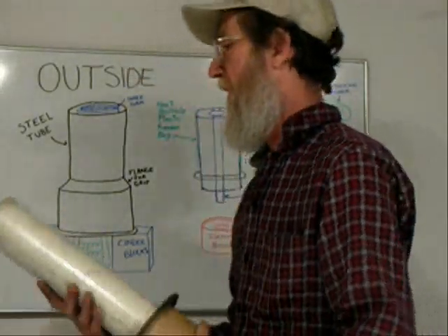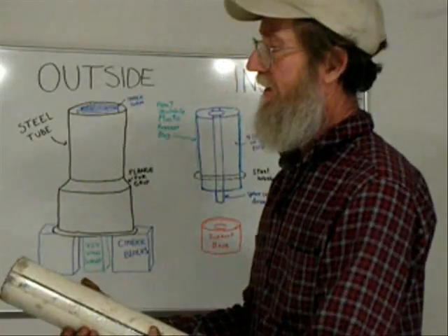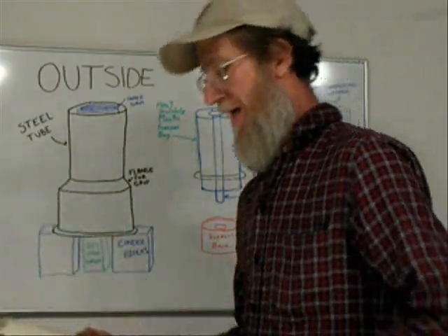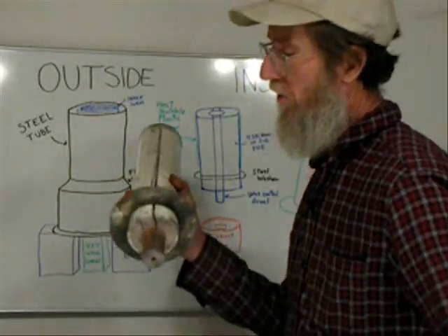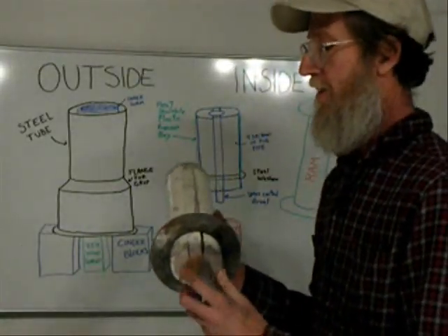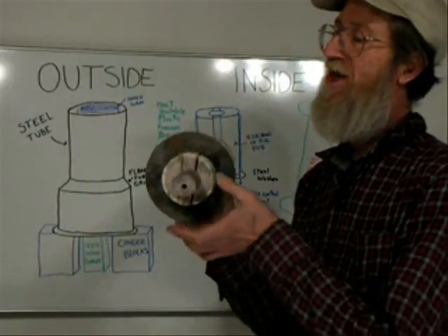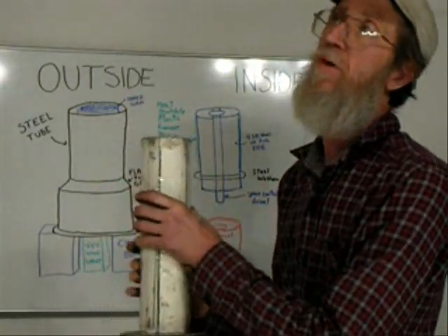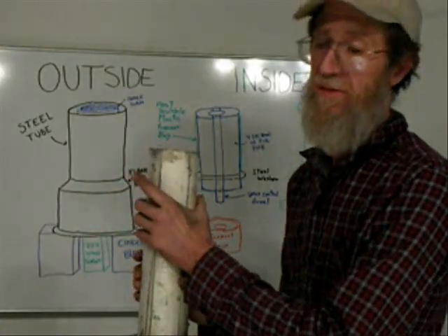This core has a heat-sealable plastic freezer bag that has been precisely sewn to fit around the sections. It is in four sections of PVC and has a support base to keep everything in place while we are pressing on it. You will notice it has a wax-coated dowel in the center. When this dowel is extracted, the four sections will come together and remove while the clay is wet. The freezer bag will keep the clay from sticking fiercely to the PVC and can simply be peeled away.